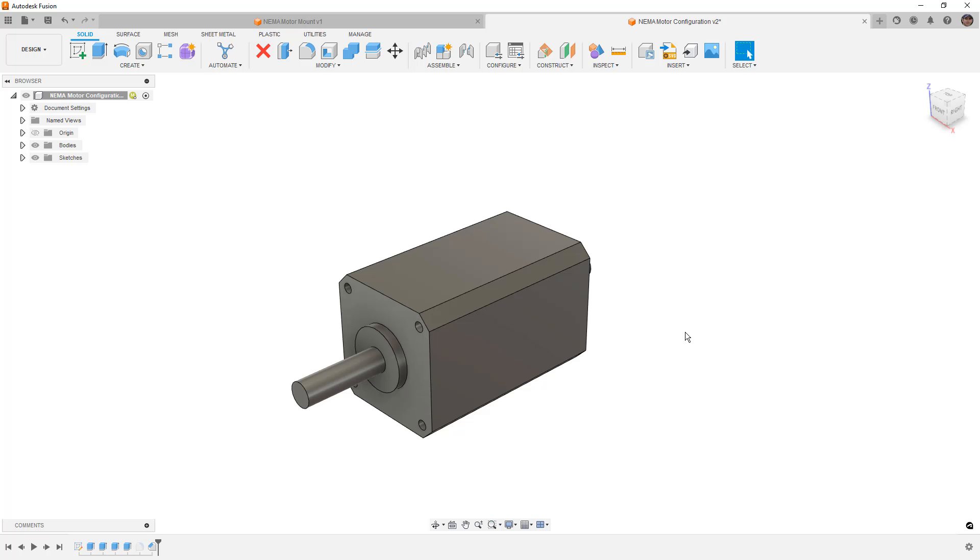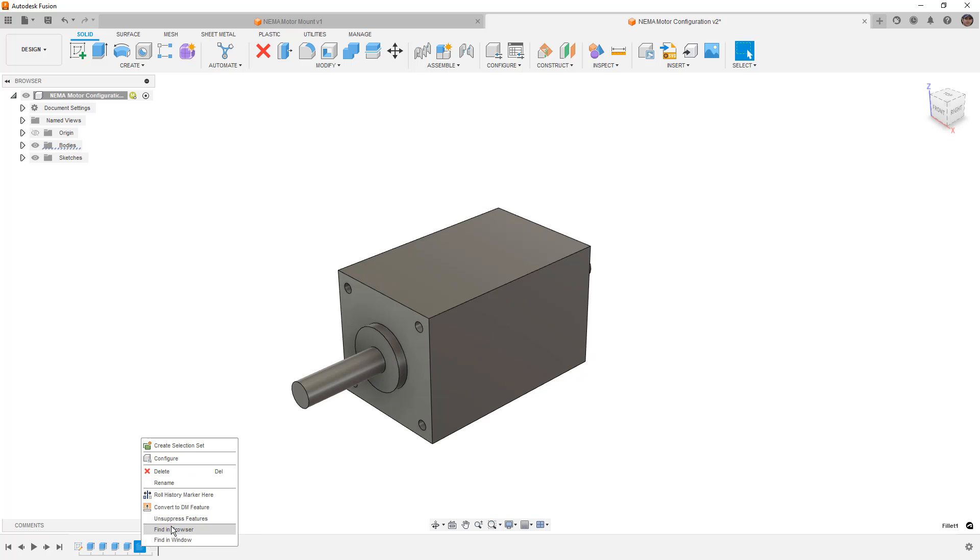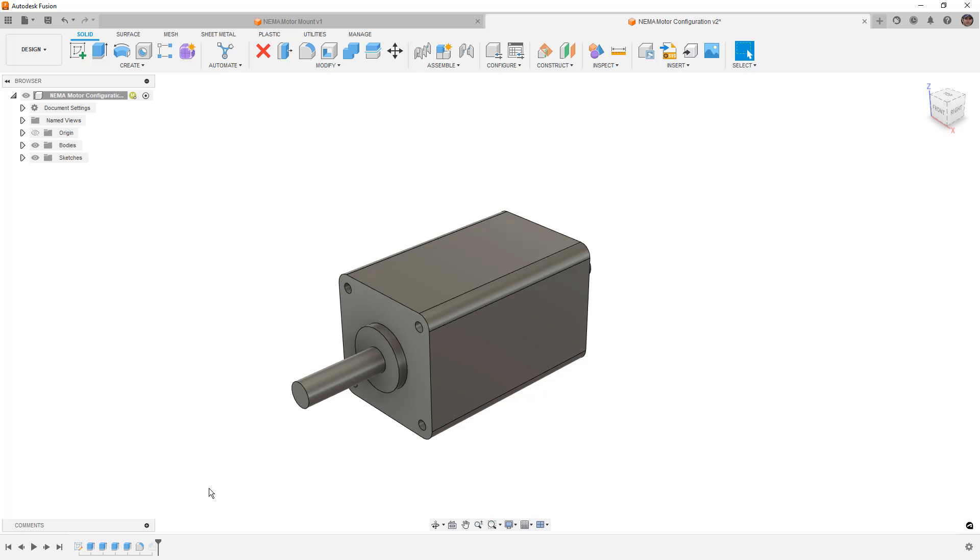If you're doing a complete configuration on a highly detailed model, note that NEMA motors vary quite a bit and some features won't configure as well as others. Using intersection curves and sketches when changing from a fillet to a chamfer will often cause problems. Generally you would add additional sketches driven off dimensions to remove extra details. For now, we're focused on suppressing and adding features. The fillet is on smaller NEMA motors and the chamfer is generally on larger housings like a NEMA 17.